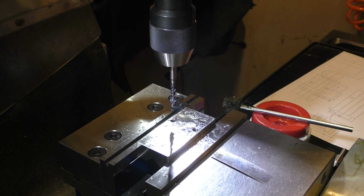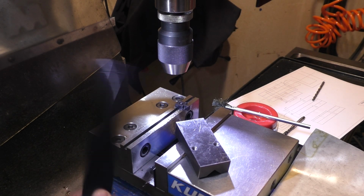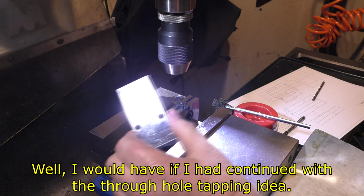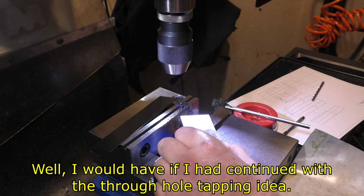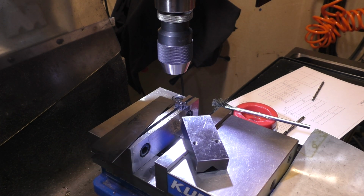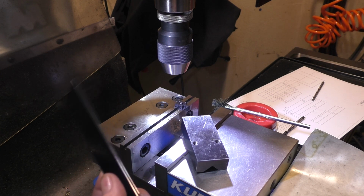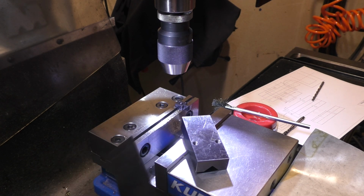And this holds the glass. This V-groove aligns the glass for the cutter and also supports it underneath the cutter for the cut. Also, just a side note, you might not have noticed, but I had to use my thin parallels on this because you can see how close the holes are to the side of the material, and the 1/8 inch parallels just missed clearing. Getting yourself a set of these, they're fairly inexpensive and incredibly useful, especially in situations like this.